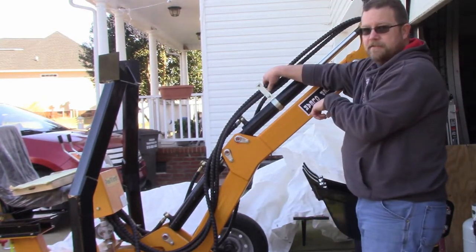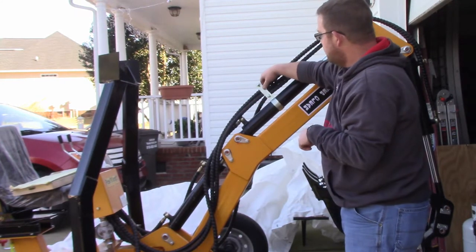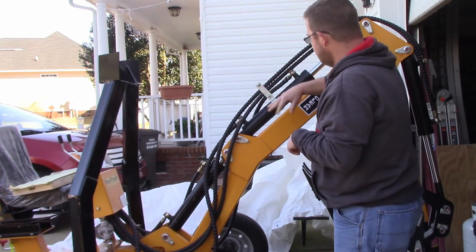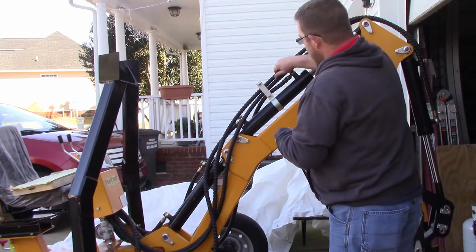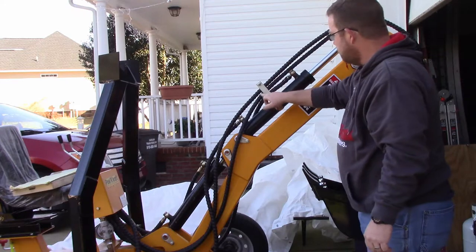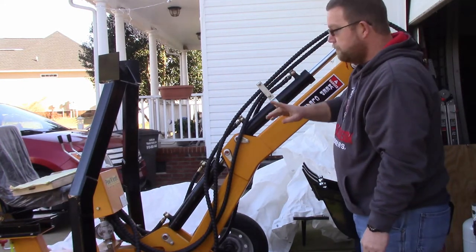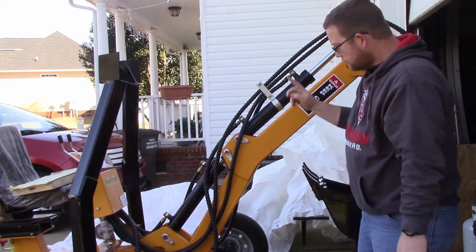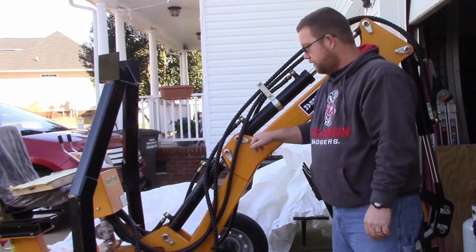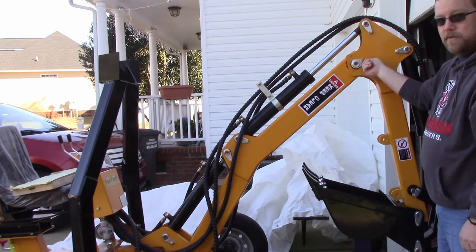I don't like this because I did notice in operations that my hose protector is coming and it's chewing it up, so I don't like how it's floppy or any of that, because this may need to come through, and what's happening is it's already starting to chew up on here. So what I might do is make a rubber insert, something for it. Just stuff to be careful with. When you're finally assembled, make sure that you go back and double check and torque all of your pin bolts, okay, your lock bolts.